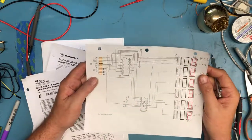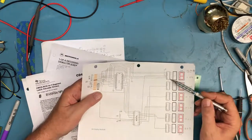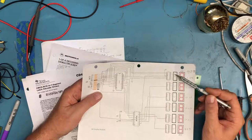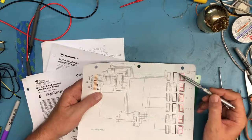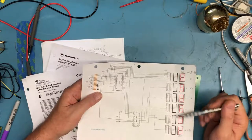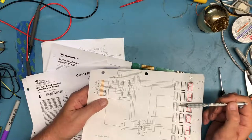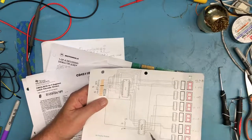But it was thinking this through, and realizing the fact that the 7 LED driver outputs here go to a resistor package, go to the LED, didn't need to be drawn in. It would just overcomplicate this, and you know that to be the truth. I didn't draw in the power rails. It's a 5-volt board. It would just add clutter here.